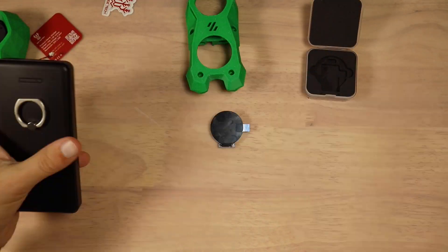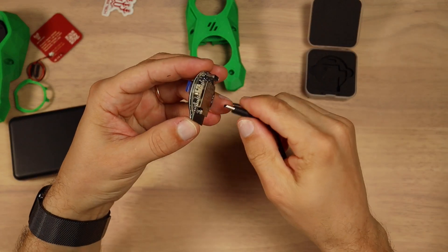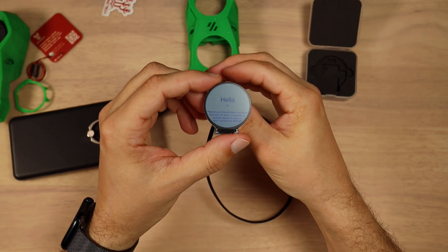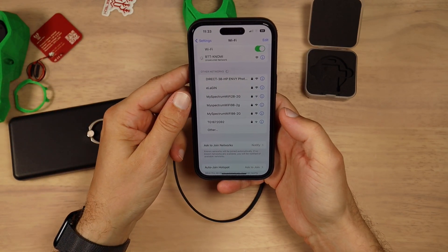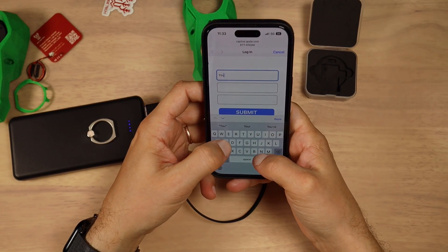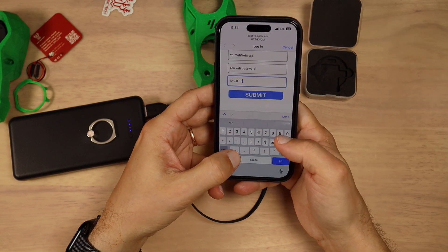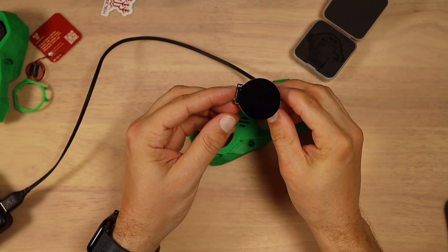Let's just try to plug it in. Now we are going to do a full reset — I have a power bank here, simple USB-C. I'm going to reset the device now by holding the boot button. It says it lost the connection. Here you have BigTreeTech Knomi — you connect to it and automatically get the web page. That web page is super simple: you put your Wi-Fi network, your Wi-Fi password, and the IP address of the printer. In my case it's 98. After connecting the device over Wi-Fi, you can see the device is ready to be used.